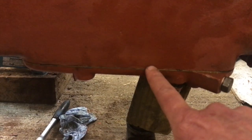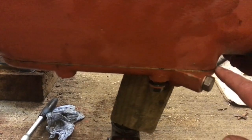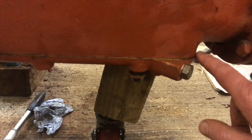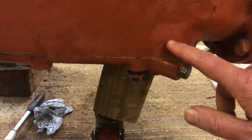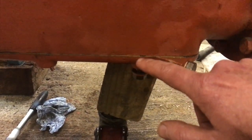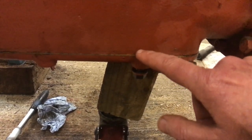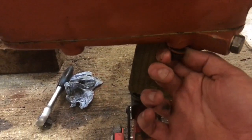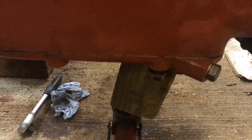And then by pushing it in and letting it ride against the face, it basically takes the gasket with it. There is no gap between here and here when you want to put it in. What was happening was, as we pushed it forward, the gasket was being pushed back. So the only way I could overcome that was to put these two bolts, one on the side, one on the other side, up against the face, and that then helped bring the gasket with it. Again, having grease in there does help the gasket to slide as you push the pump forward.